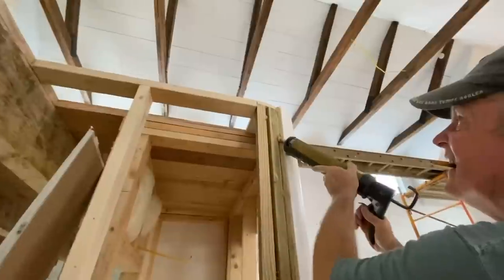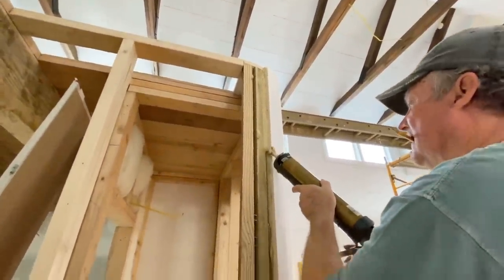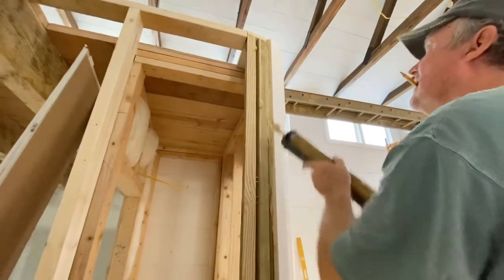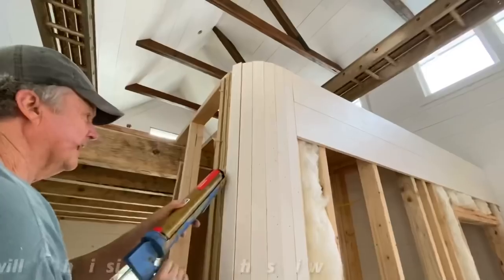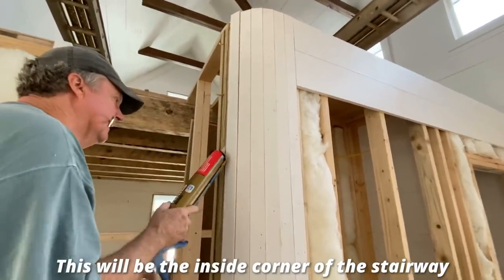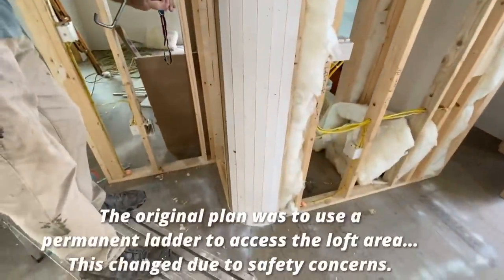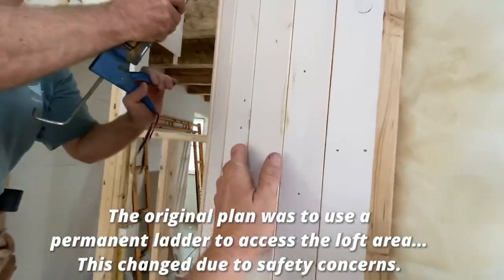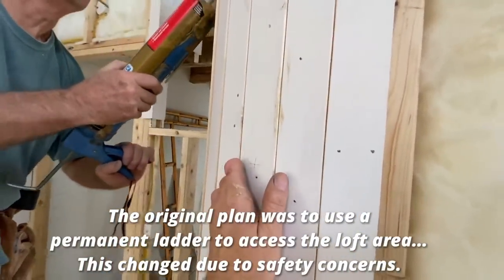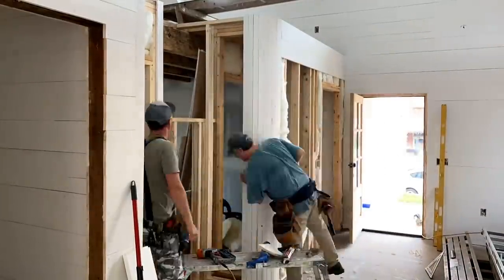We are working on something a little crazy right now — we're building an outside radius corner, about a nine inch radius. Arlo is filling in the cracks between the framing. It's curved, but kind of faceted. The way I decided to do this is to rip two inch strips of wood, rabbet the edges so the front face would be tight-ish, and we're just gluing and nailing them on. A little wacky, a little unconventional.